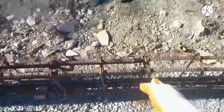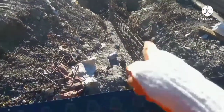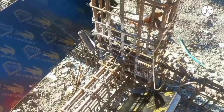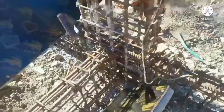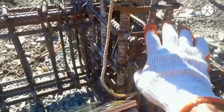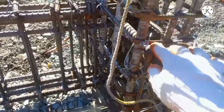We spliced the rebar in the middle area, mga katigma, because our bars are 7.5 meters long. We centered them in the span and alternated the splice locations so they don't all fall in the same place. We made sure not to splice at the center of the post — as always advised by our engineer and architect friends — splicing at the center of the column is not allowed. We often see this problem in other construction sites, where the splice is placed incorrectly at the column center. It should be at the lower zone of the post.